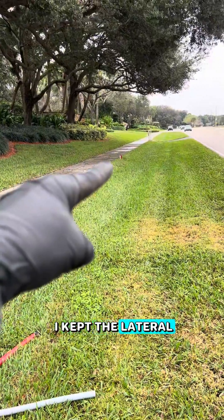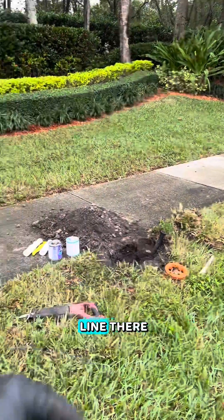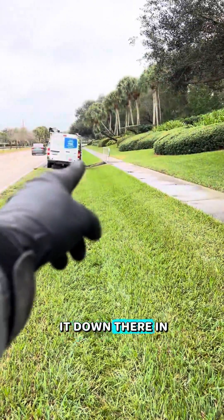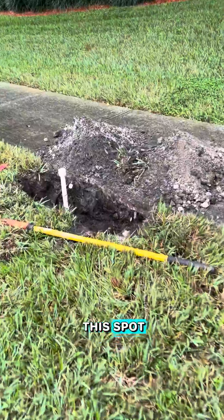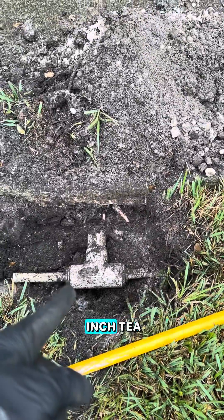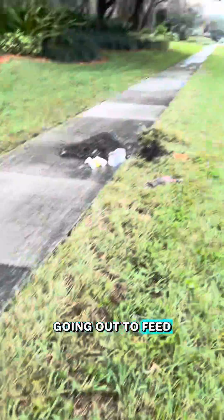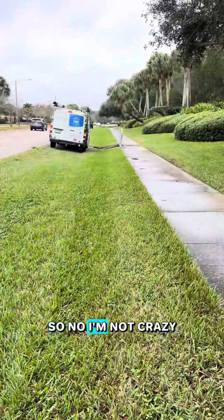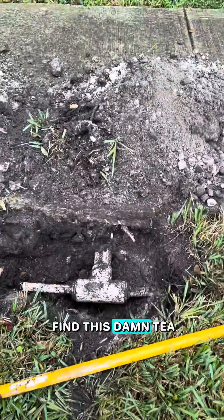Let me show you. You can see where I capped the lateral line there — I was starting to cap heads in here. I capped it there and down there in a couple of spots, and I worked my way over here until I got to this spot. That is a two-and-a-half-inch tee with one-inch on either side of it going out to feed this whole zone. So no, I'm not crazy — they did run the whole zone in one-inch pipe, and that's why it took me forever to find this tee.